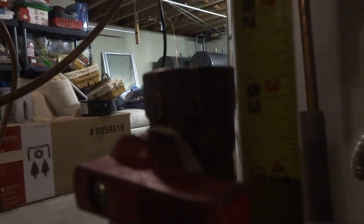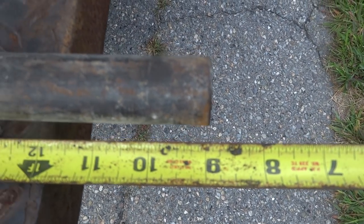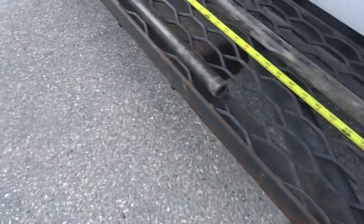Alright, so I got a union there, and then a shutoff, and I gotta cut a riser piece and then go over. I wanna be 9 off the ceiling with the thread, right? 9. 9 and 63. 9 and 63 is the piece I want. Alright, so we got a piece there at 9. And I'll just have to mark 63 and we'll thread both ends.